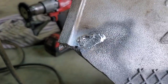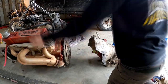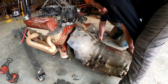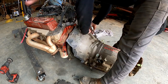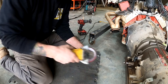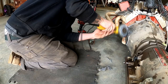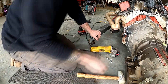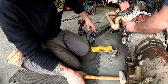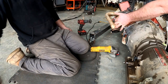I'm going to go ahead and say that preheating, obviously with cast, is the better move. I just pulled a little bit of heat out of it because I'm way too hot. Really getting this bolt in is what's going to make me feel better about this — it's certainly not tight, just snug.